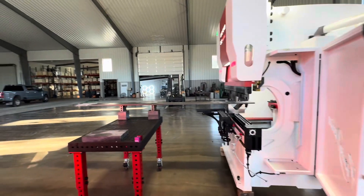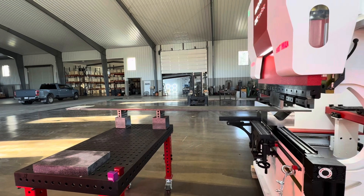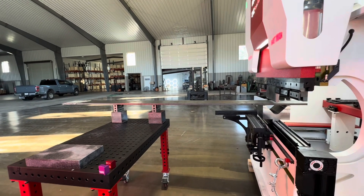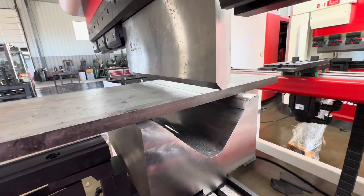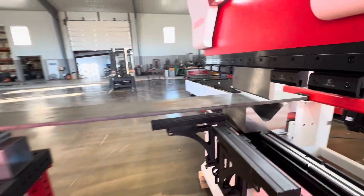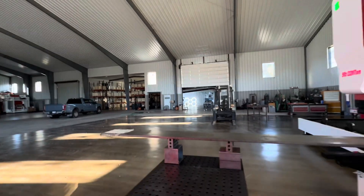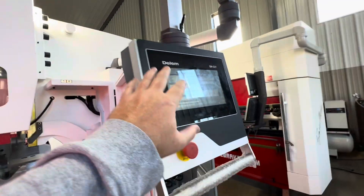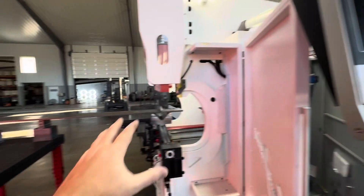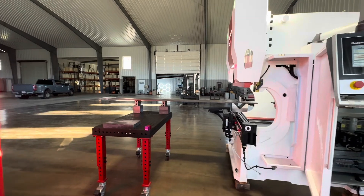You saw the thin aluminum — how easy we could let that down — but really, even if you didn't let it down slow, that's not a big problem; nobody's going to get hurt. This three-quarter inch flat bar is different. Let's say we need to put a six-inch flange on one or both ends. When we make a 90-degree bend this is going to be way up in the air, so slamming back down is an issue. We have all these variables we can control with a very precise level of detail for what's happening with the ram.